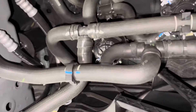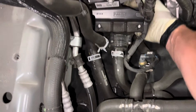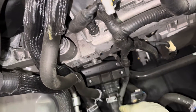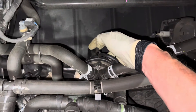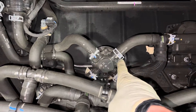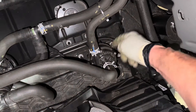So this is the glycol loop you're looking at right here. It looks like we have a pump right there — that's one of your glycol pumps. This little one right here might be a valve for on/off or a small pump — I'm not sure yet. No, it doesn't have much of a body. This one's definitely a pump. And this one right here is a four-way valve — all that is is a valve inside that decides which direction the glycol is going to move. One, two, three, four — it decides where the hot or cool will go. And we have another pump here — that's our second glycol pump.